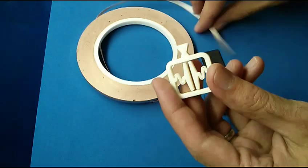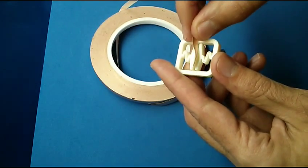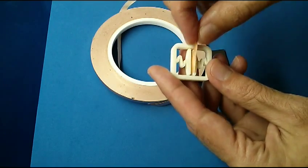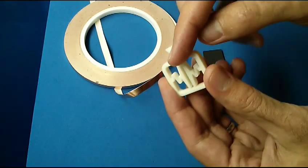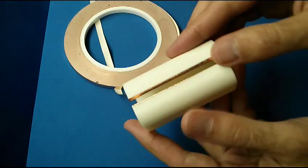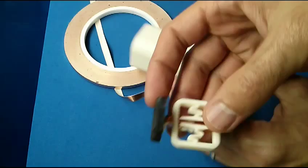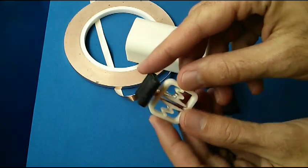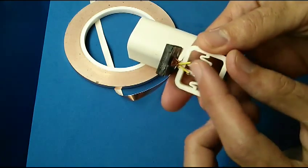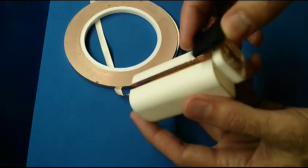I use conductive copper tape on both sides here to form this wiper. Then I put copper around here, and I have these copper rails that it runs along. So in the end you get this — copper here connected to copper up here, forming a little slider thumb that just runs along these rails.